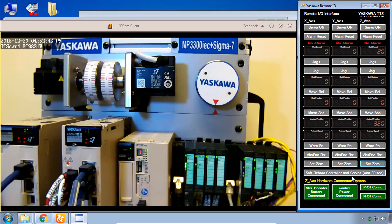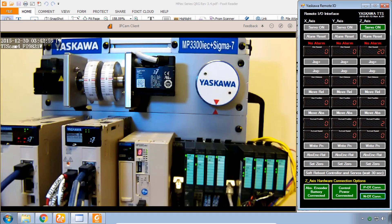You can see there are a lot of controller reboots involved when replacing any components. Write the parameters if you replace the amplifier, and reset the absolute encoder if you replace the motor. I invite you to play around with this demo as much as you want — simulate the replacement of each component and go through the recovery process using the web UI or the remote I/O until you're confident. In the certification test, we'll ask you to load an archive and use the functions of this interface.